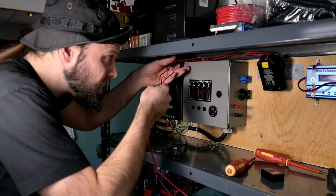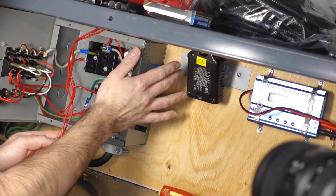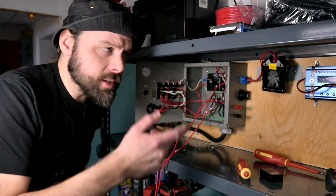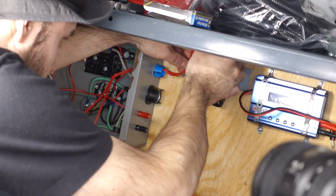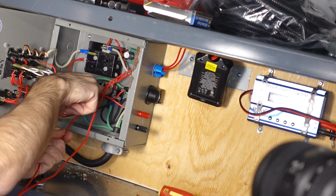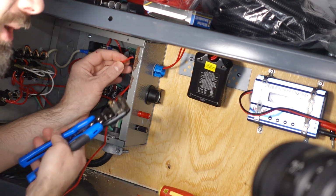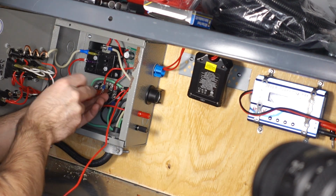The next order of business is to get this wired into the box. And that's what this silly blue thing that I installed is all about. Just push it through the hole. Now here's where we really gotta start using your pay attentions because they're both red, right? So the black wire, which one's the black wire? This one's the black wire. So that's the black wire. I gotta get that onto the ground strip. Like right about there like that, bud. Okay, gonna mark that with my fingernail. You see, no wire waste this way. More crimping. Yay. Get that onto a ground strip position.